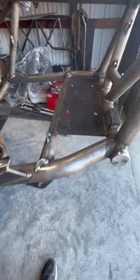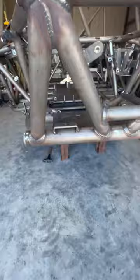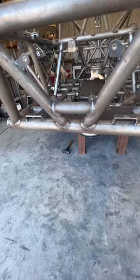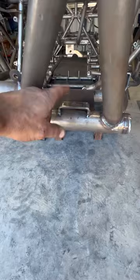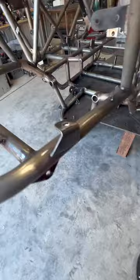And then we have the winch plate here, which kind of ties the two sides together up front where the limit strap tabs go. And on the front side here, we've got this 1½ tube that creates this pocket for your winch line. So no need for a fairlead. Your winch comes right through there and you're good to go. We have a couple platform tabs here for lights and then another one right there. And then, like I said in the last video, the motor mount setup on this is for LS.